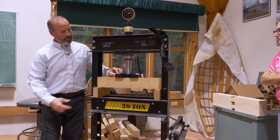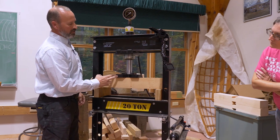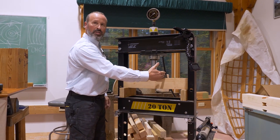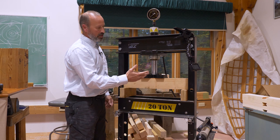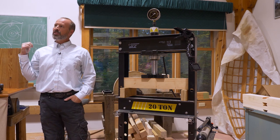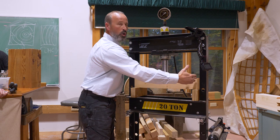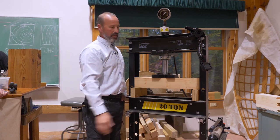So you'll notice that I have this big block of steel here. And this block of steel is attempting to take our point load and turn it into more of a uniformly distributed load. All right, so it is obviously going to make this beam perform better than if we just had this point load, but we based our numbers on WL over 8, a uniformly distributed load that should be acting all the way across the beam. This is what I have to sort of imitate that load.